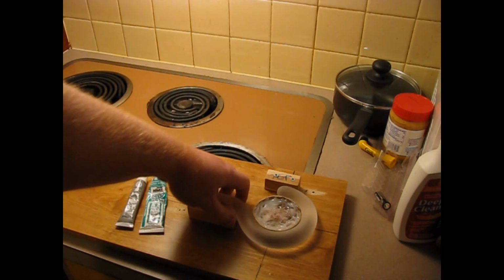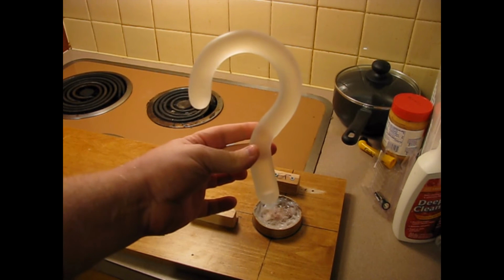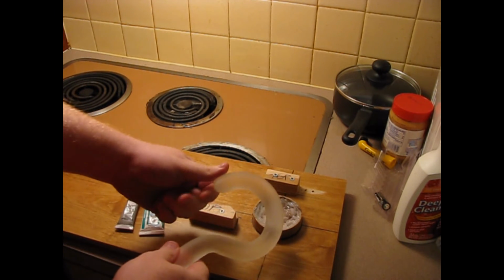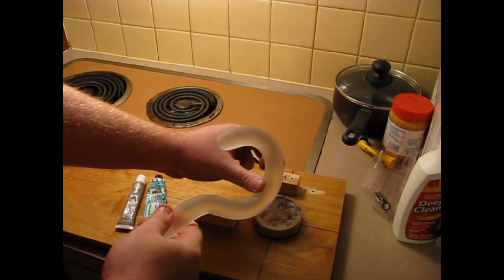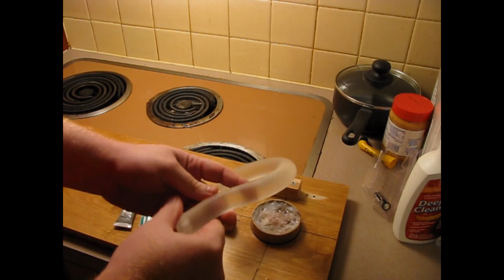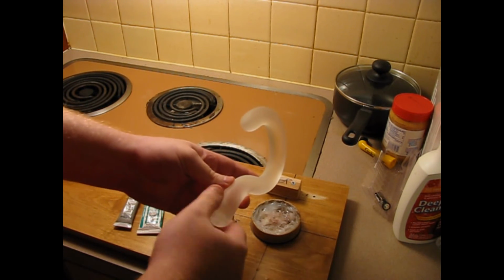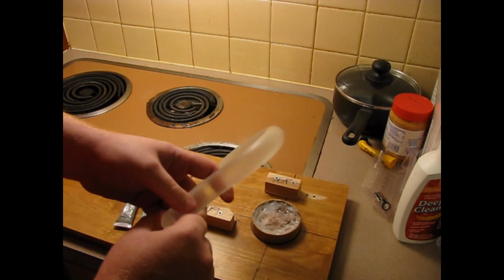Alright, the handle has had time to cool, and as you can see, it's a pretty decent shape. Now, there are going to be some flat spots on the handle. Right up here where it was butted up against the stop, on the inside of the handle where we bent it around the 3-inch lid. Our corner here is going to need to be filled in with some filler, and there's a flat spot here where we pressed it against this stop here with our thumb.